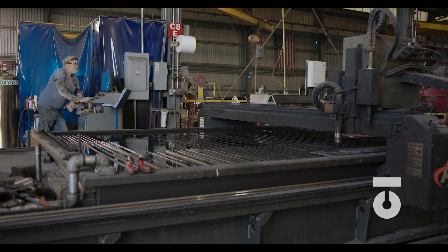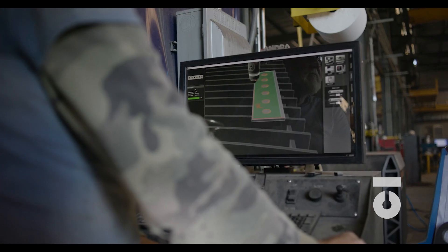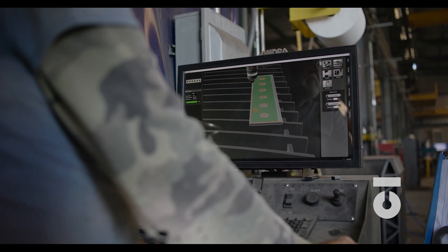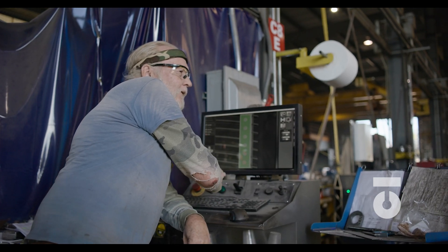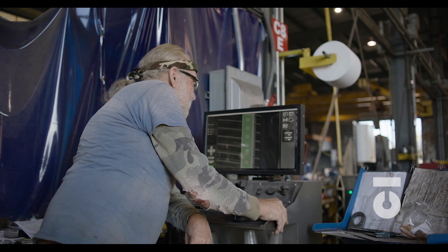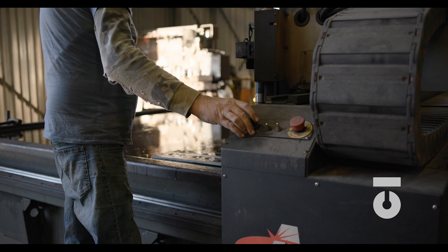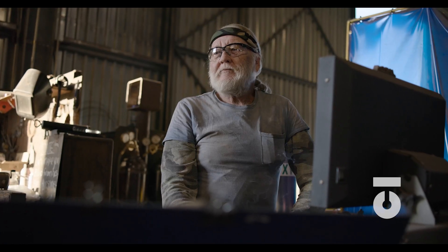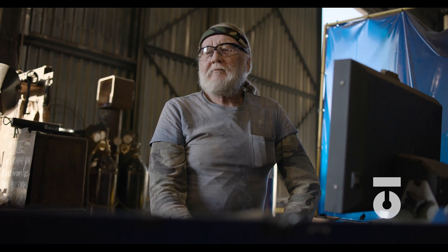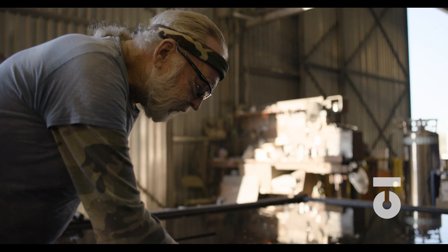We have our plate that is 3/8 inches wide by 4 by 8 feet long. We have our steel sheet on the plasma table and we are ready to cut. With plasma tables or CNC machines, you won't need to measure 112 pieces on that sheet of steel; however, you will need to input your data and files properly in the machine. Before starting, just as the rule of measure twice and cut once applies to manual cuts, the rule here is check your data input twice and then cut once — look at the machine's dimensions that have been input and then reference the cut list and the part sheet. If they match, we are good. When cutting this many parts, it's always good practice to do one test run for one part, so you can pull the part and check its physical dimensions to your drawings as a third check and balance — the plate needs to be 4 inches wide by 1 foot 6.5 inches long. Now that everything is squared away, we are good to cut.